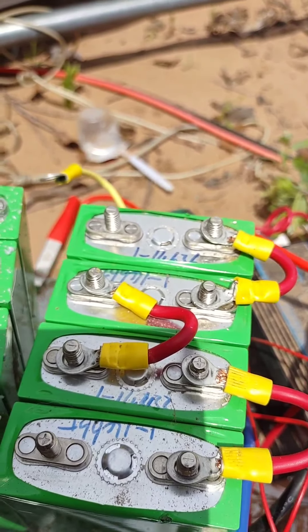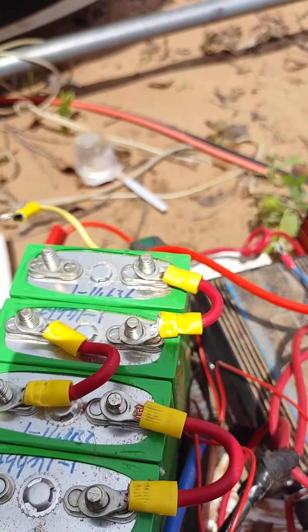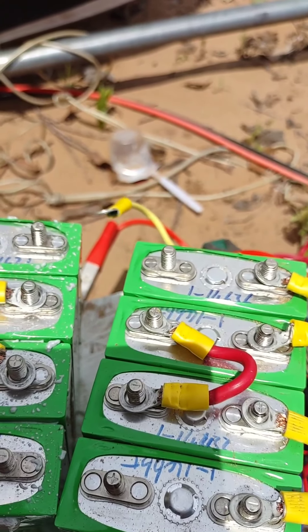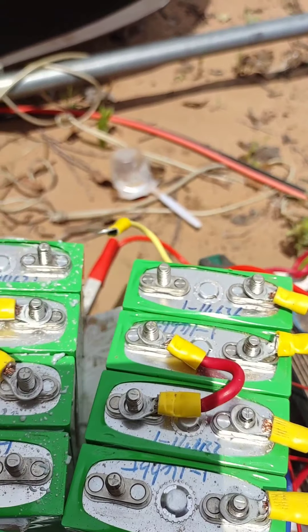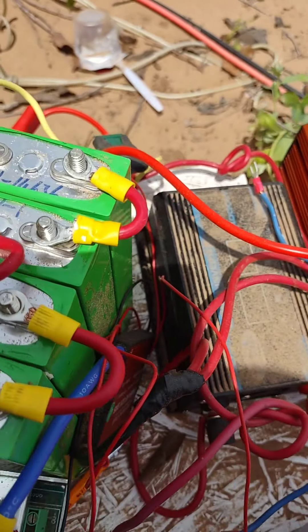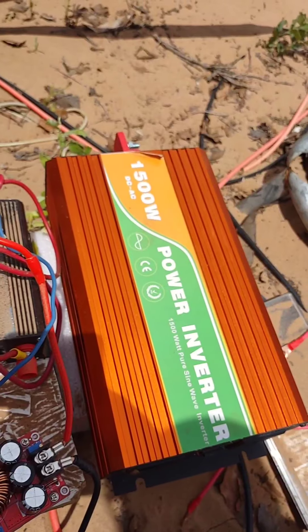I made sure I balanced them first. By that I mean I just put four of them together in series, four of them together in parallel, until they all broke down to the same voltage. That takes like a couple hours. I'll show you how to do that in another video. So now I've got two 12 volt battery systems — this one is 13 volts, this is 13 volts, it's a 12 volt system.